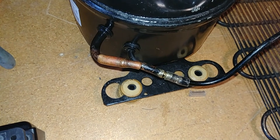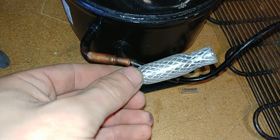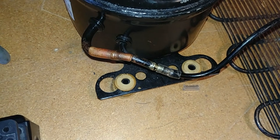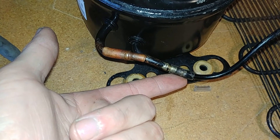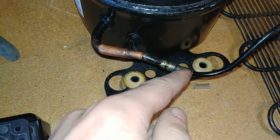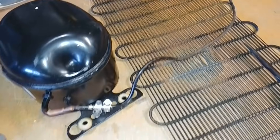Even my last 3/8-inch tubes ballooned up almost 3 times their size when compressed, and then popped. So we're going to use a small 1/4-inch tube along with a ton of hose clamps. With that, I turned on the compressor and checked to make sure there weren't any leaks.